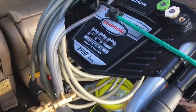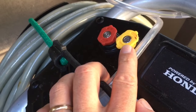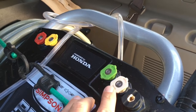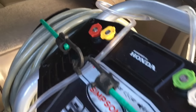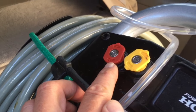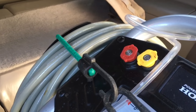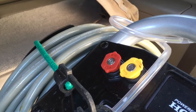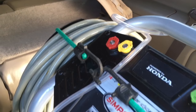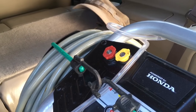But like I said, I don't use it. So with mortar and cement, we're going to go with this yellow nozzle. The green and white are more for doing decks and siding. The red — some people call it the laser nozzle — this is how you flay yourself to the bone. It shoots a solid stream really, really hard and you can do a lot of damage really quick. It's very rarely used — it's for getting gum off the sidewalk or something. It's one of those that's there for emergencies. That's why it's red, maybe.